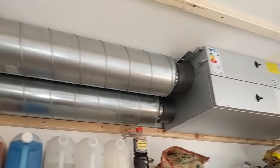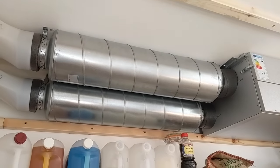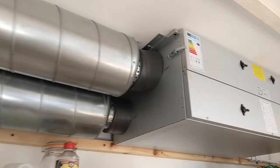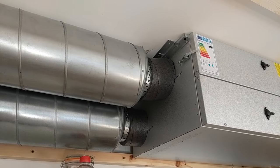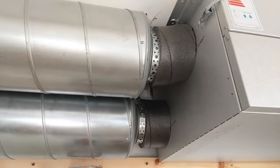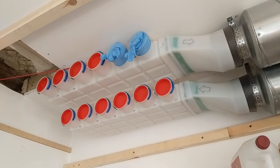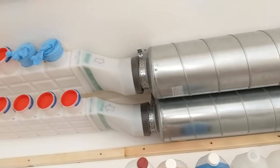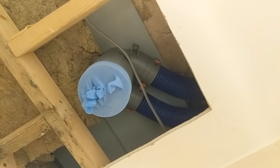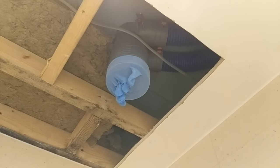From the unit we've got two acoustic silencers — these are 900mm long. I've got them from Lindab and I've gone for the rigid ones because they've got much better damping properties. There was a little problem at this end where the unit couldn't fit the silencer in, so I've had to put a connecting piece in just to bring the silencer a bit lower. I've connected the silencers up to the ceiling with some metal strapping, and then they go into the manifold. The manifold connects all the internal ducts — one for extract air from the toilet and kitchen, and one for supply air. I've marked with arrows which way the air is going so I don't forget. It's important to fix the terminal and the manifold first and then connect the ducts up, and I've covered it to stop any dust getting in with a rubber glove.